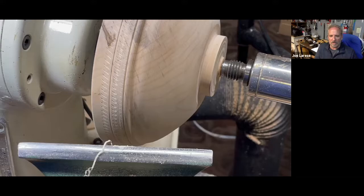What I've realized is that I don't even bother with that stage or incline plate, because depending on the diameter you really can't keep a record — even with a slightly enlarged open form, it changes. What I've found is that you almost let the cutter find its way into that groove and it'll actually kick. You listen to the sound and get a good sense of whether you're chewing the wood up or if it's falling into the right pattern to repeat itself. Nick Agar is the expert at using this, and Carl Ford has also, if not mastered it — because I don't know if anybody masters it — you have to be ready for some random results. But it makes a pattern very quickly and it looks like it took a long time.